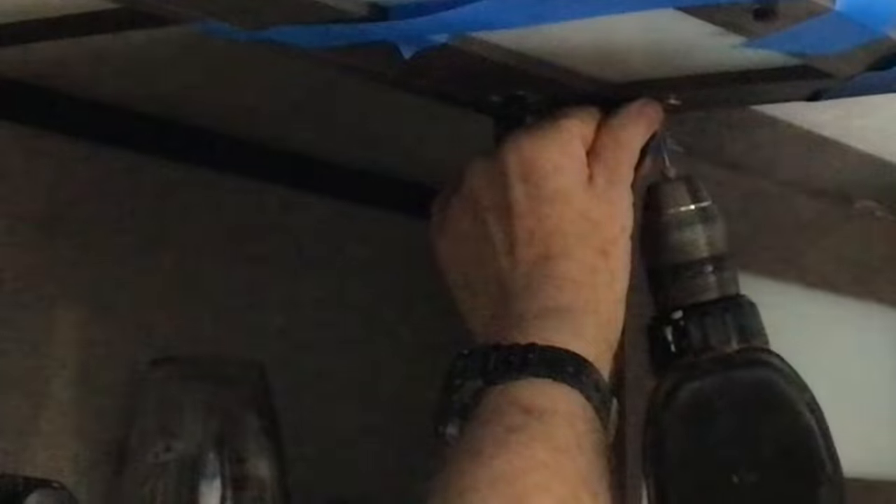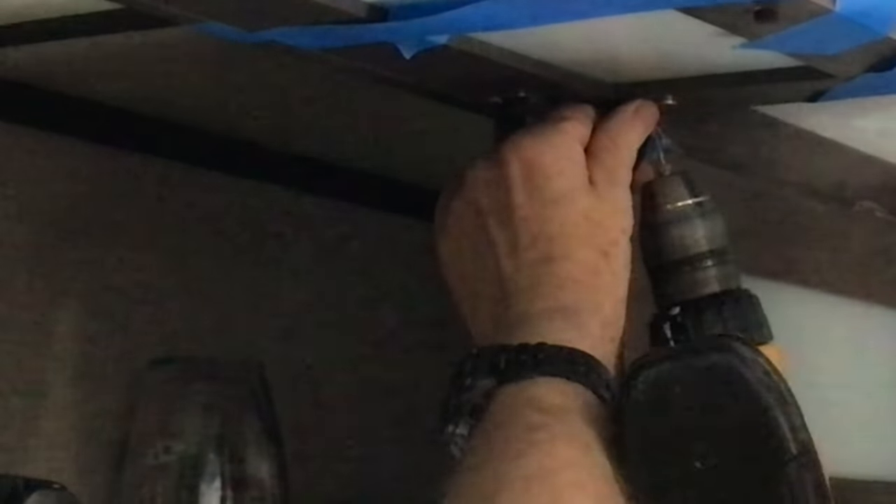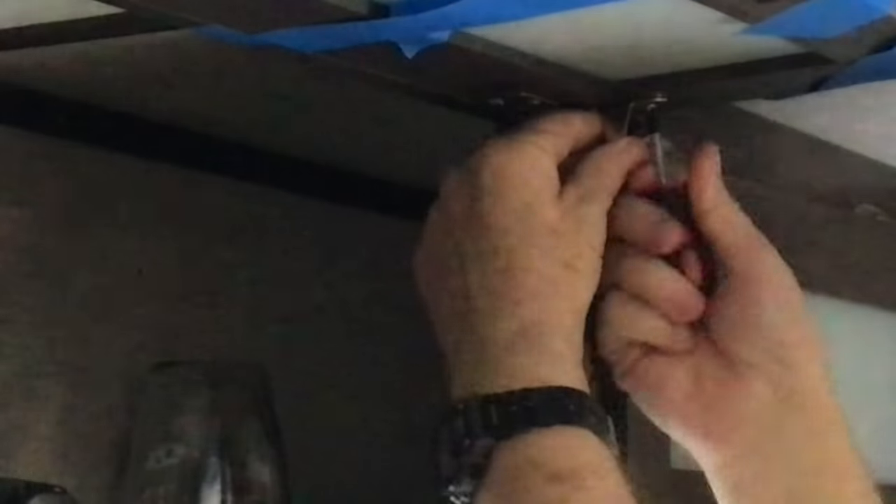Theoretically, all I should have to do now is drill my holes for the top part using my little tape depth gauge so I don't drill through the door face. I seem to have it pretty straight - that looks good and it also lines up with my mark. I notice there's a bracket for the ball joint up there. I've intentionally made sure it's on the inside so it doesn't bump into this beam or piece of wood right there. I drill the two holes with it in place. Theoretically we're done - let's find out.